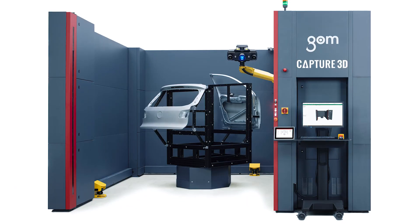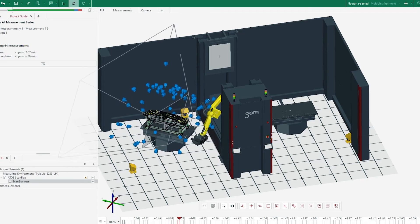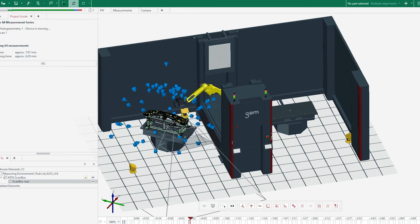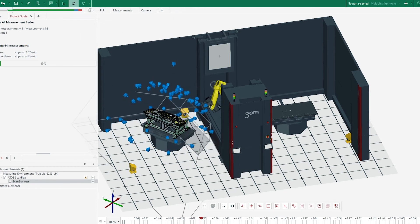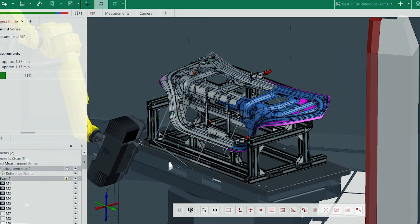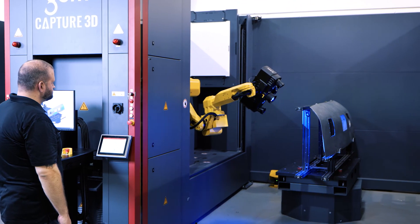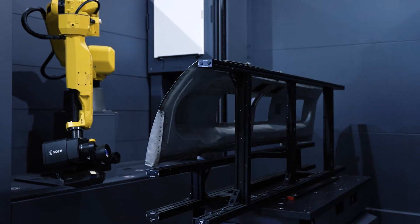Now that we've covered the main hardware features and specifications, I want to give you a quick look into how the software functions as a crucial component to this automated solution. Every ScanBox comes with a software module called VMR, or Virtual Measuring Room. You can easily create and execute inspection plans even if you have zero skills in robot programming. VMR makes it possible to virtually simulate your measuring environment and allows for easy offline and online programming. You simply drag and drop your CAD data, then import or create your measuring plan, and the SmartTeach function automatically calculates the optimal scan positions without ever having to access a teach pendant. The software also supports CAD files with embedded PMI data and saves you a ton of time when creating your projects.